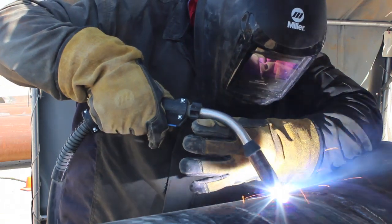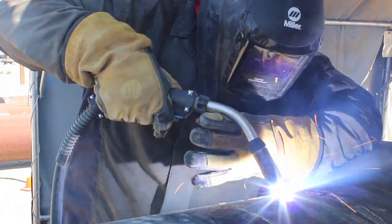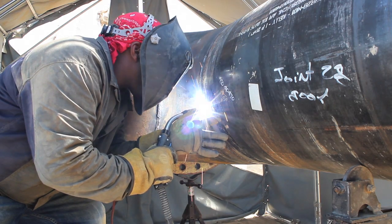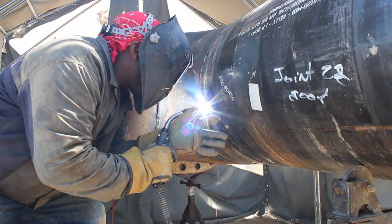If I was comparing stick welding to flux core welding at the parameters that they were running — for example, if they were depositing a couple of pounds per hour with their stick electrode process, they had stub loss and things of that nature. With wire welding, it's a semi-automatic, continuous process, and now we're depositing about nine pounds per hour versus two pounds per hour.